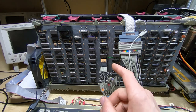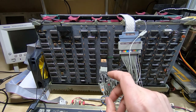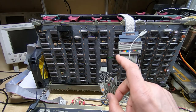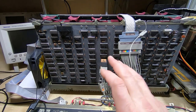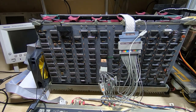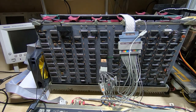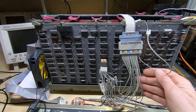What I've decided to do is take out the four PROMs on that particular line, read them, and see if any of the bits appear to be stuck. I don't know what the content should be yet, but if any bits aren't toggling that will tell me the PROM is actually faulty. I won't be able to do much about it at the time, but I'm just trying to narrow down what faults this machine has. I need to get the CPU up to the point where it can kind of limp along.